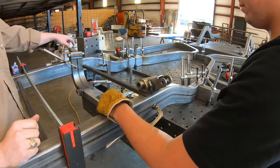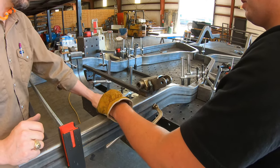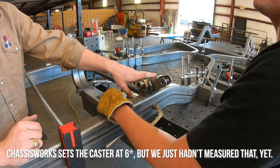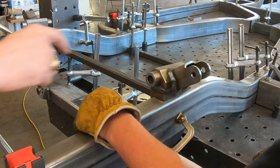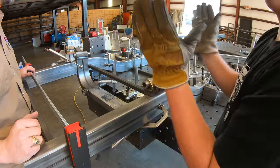All right. We'll just put the angle finder on here. And say that whatever it is relative to this, let's assume for right now this is flat, this is 90, and that this is off by 10 degrees. We'll set 10 degrees instead of trying to do this deformed tube wall, because that's put in with a fixture and it's a machine part. So I think that's going to be truer than this tube wall. Yeah, I agree.